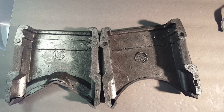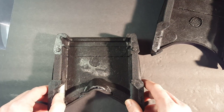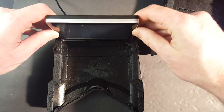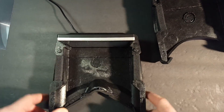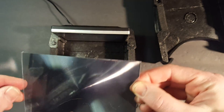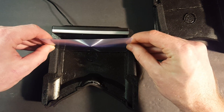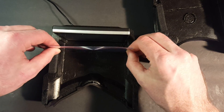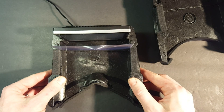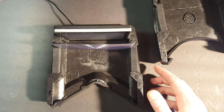Here again are both sides of the goggles complete. I'm going to start with the bottom half and begin installing. First I'll put my screen in, then I'm going to take my freshly cut fresnel lens and put the smooth side facing where my eyes will go, and slide it into the grooves that I just cut. By making those grooves and installing it into them, it can't slide around or become unaligned from the screen — it'll always stay nice and straight.